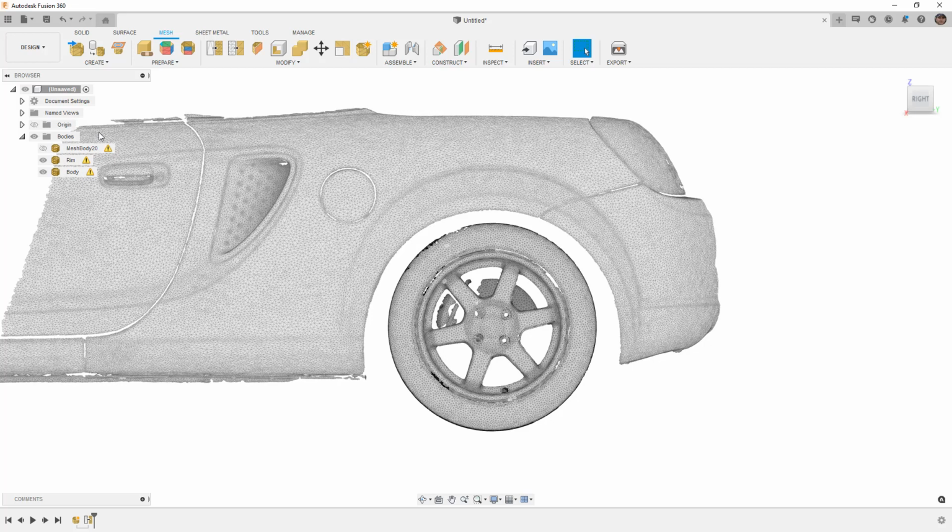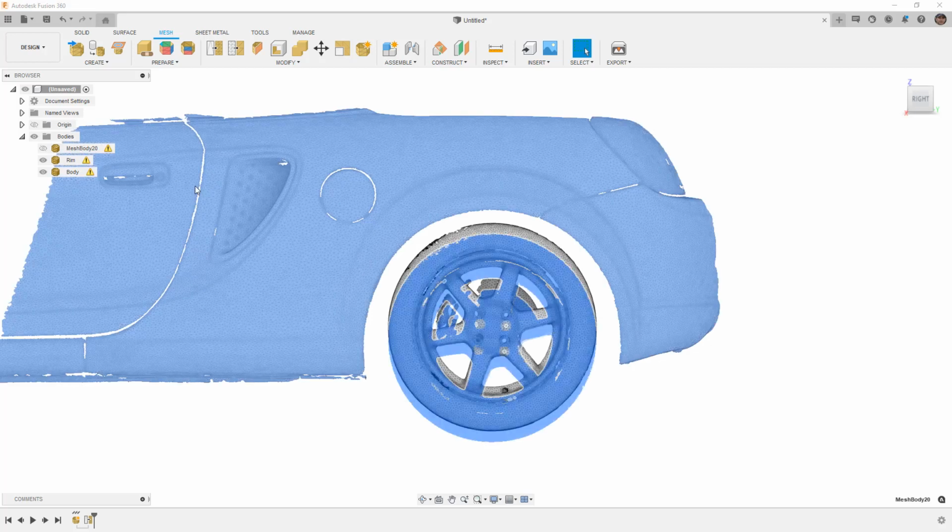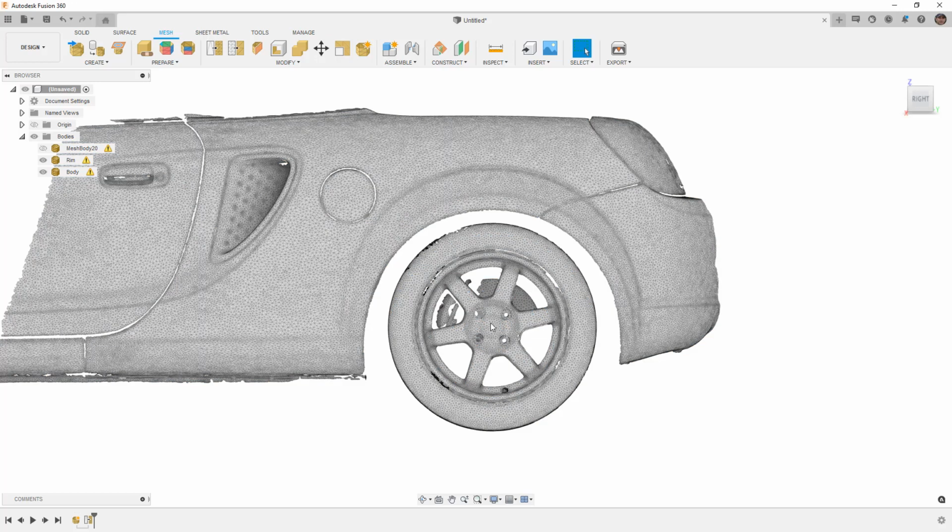Another thing that we can do if we want is we could remove some additional material. So for example, if you were planning on cutting out the original fender. A lot of times when you're lowering a car, you can just roll the lip of the fender if you need extra room and you're just putting a little bit wider tire. If you are actually getting into a situation where you are pushing the wheel out and lowering it, a lot of times you're going to end up having to cut some of that fender away.